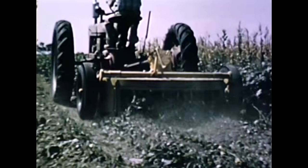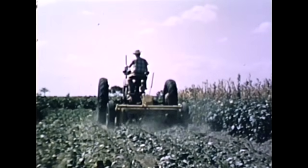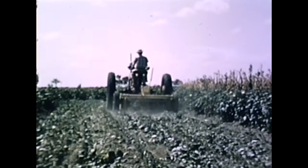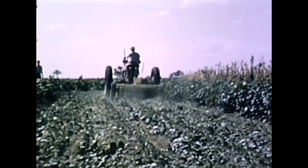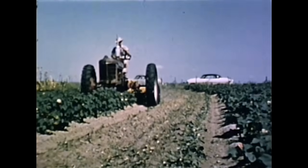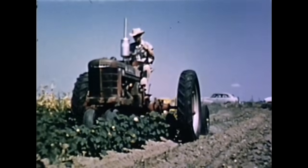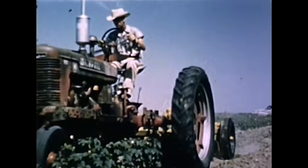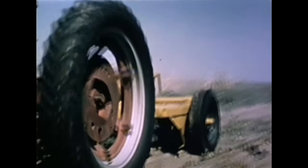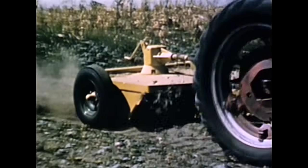The destruction of cotton and corn stalks after the crop harvest has always been a major problem in farming. The rotocycle cuts, shreds, and distributes these old stalks that they might be turned under. Yes, the patented mulch basket of the rotocycle causes the cut stalk to stay under the cage until it is shredded. This is accomplished by the high-speed chrome alloy steel heat-treated blade. The destruction of stalks in this manner greatly assists in soil building. The shredded material deteriorates quickly. This organic matter is returned to the soil, enriching it for future crops.